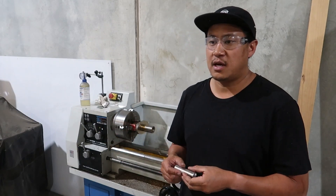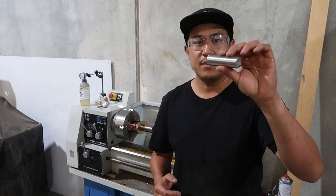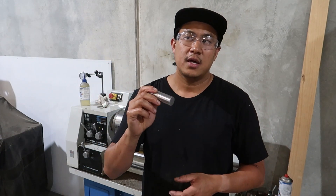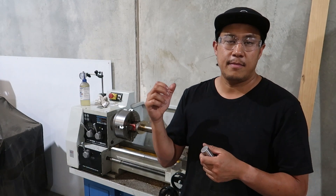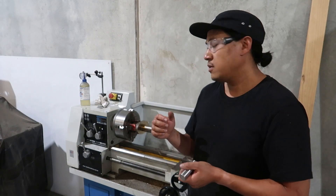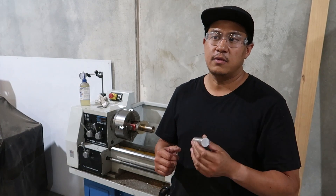We got the drive shaft from Stirling Steels today — this 25mm drive shaft. The idea of choosing 25mm instead of 25.4mm is that if ever this prop bearing or other components wear out, I can always increase the thickness of the drive shaft, which is a nice option. But I believe it's meant to be 25mm anyway.